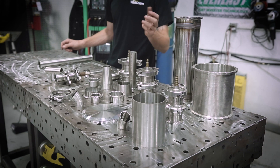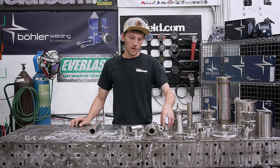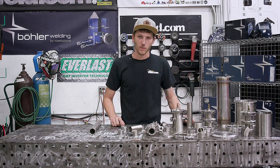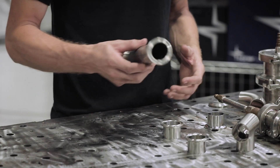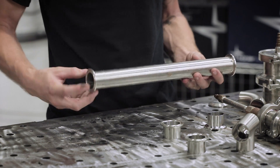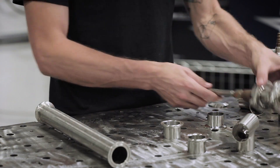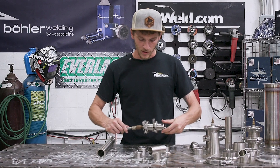These are some of the components you'll usually see when spinning parts out. You'll usually spin out a lot of ferrules, valve bowls, 90s, reducers — whatever it may be. You'll need your dual regulator because you're going to purge this stuff as well. You can use a holder piece which you just spin in the bench. I also have a quick disconnect piece that I clamp in the bench, and that allows me to just spin the part.